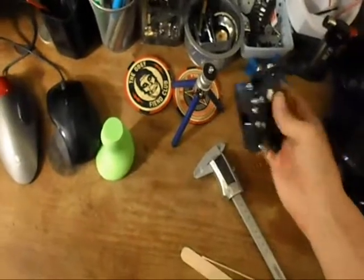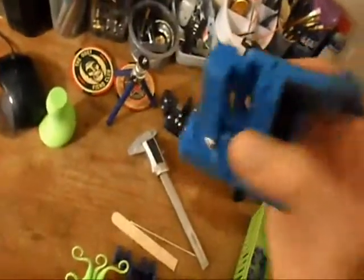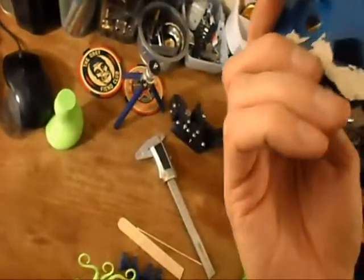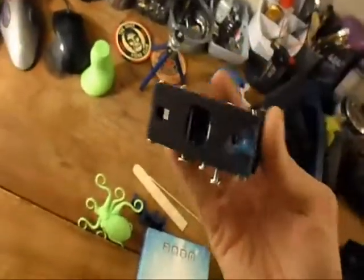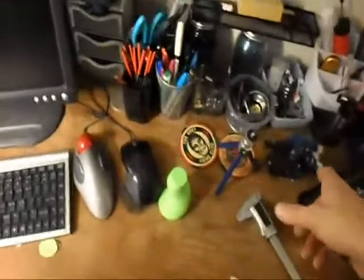Here are some extruders previous to the current new extruder, which you've seen in some of my recent videos. This is basically an ABS Wade's tilted extruder right here. I like the gears on it, but I really didn't like this too well. It didn't deal well with the heat, but the wooden extruder deals awesome with the heat. They sent me this, and when I built it first, I was a little cavemanish about it and a little crazy, and I made it work, but I called it the Franken extruder. Now I have a perfect extruder from BLUErBOT. If you can, try to build it exactly as they tell you, because if you do, it'll work out great. You won't have to fight it as much as I did.